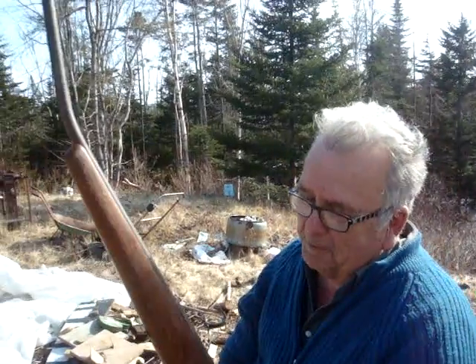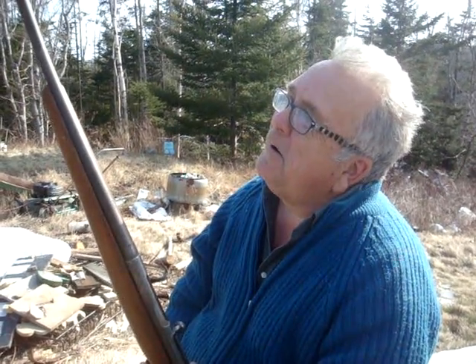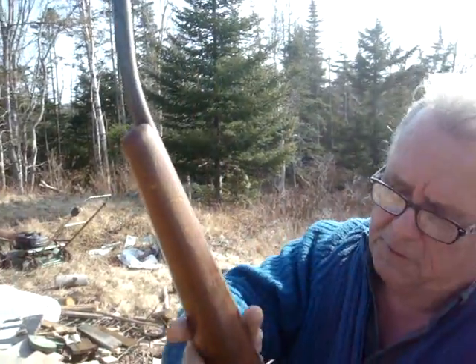It's hilarious, you know, what I've seen over the years — the damage done to guns. Anyway, I'm going to pry and straighten it. The only thing I'm worried about is it kinking, so I'll fill it with sand before I try to bend it.